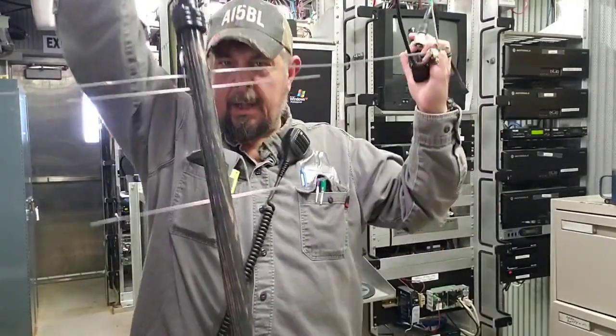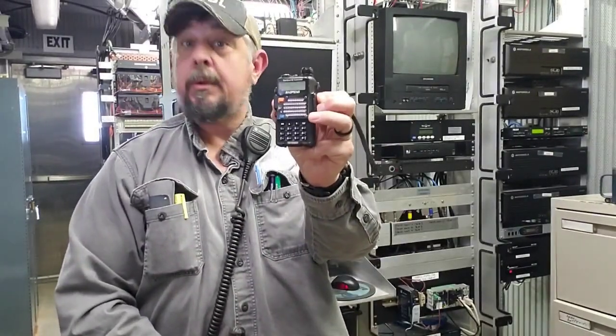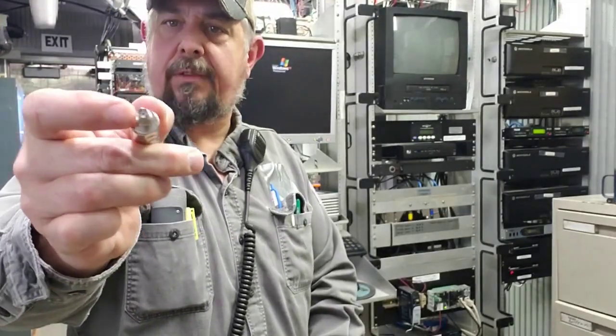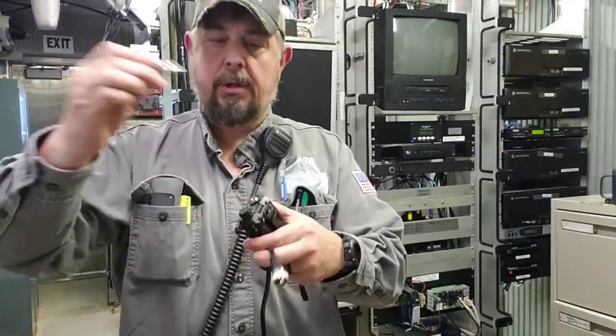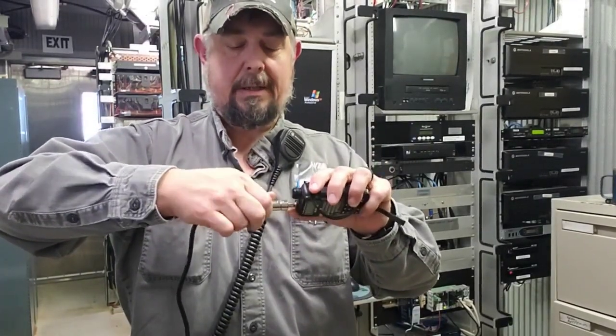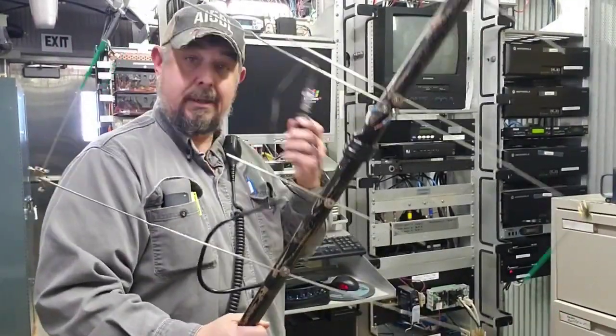You may be thinking, how am I going to hook up this great big antenna to this little radio? What you do is get one of these — this is an SMA female to an SO239 adapter. My radio is a Baofeng BF-F9V2 Plus tri-power, but anyway, get one of these. Your PL-259 from the antenna screws right onto it. You just take this thing, screw it right into the antenna there — that works good.